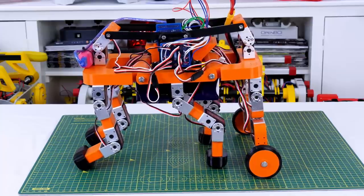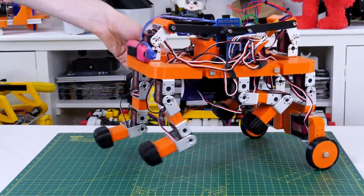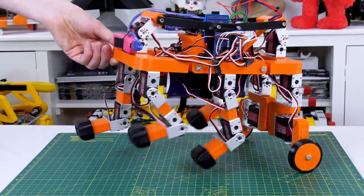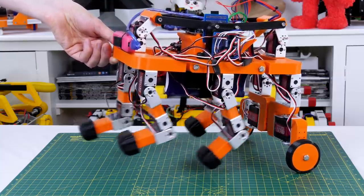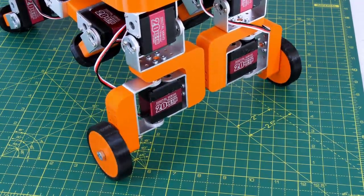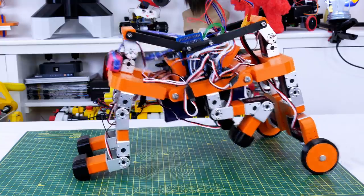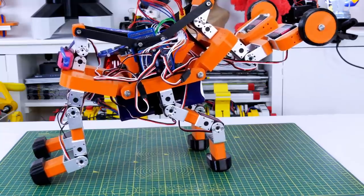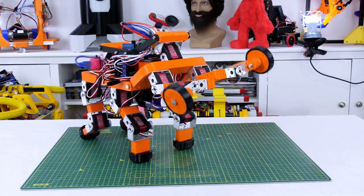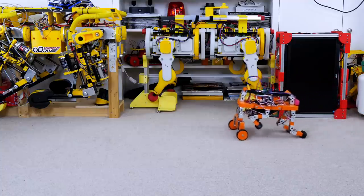I coded a mode switch on the remote so I can pick up and put down those front legs, which aren't always going to be in use, and that seems to be working pretty well. I programmed a state machine with flags and timers so the legs move in a satisfactory gait. The robot also has a four-leg mode which moves much slower with a higher step so it can climb over objects, moving in a trot gait with diagonal legs operating in pairs. The steering is now working — I just twist one of the sticks on the remote. The back and front body servos now move in both directions, allowing the body to flex so that in either two or four-leg mode the robot can blend with the terrain and hopefully climb up and over objects. Everything is manually operated like a radio controlled car, with the legs running along when I push forward on the joystick.